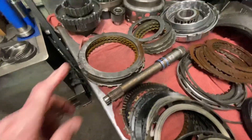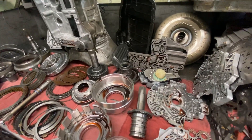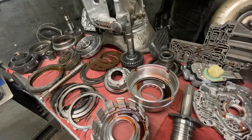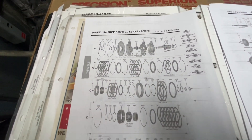Here's the input shaft. They do have upgraded input shafts. This particular application is a work truck — it's not a truck that the guy's going to be doing any heavy modifications on. So we looked at it and figured that the modification to the housing, which is very prone for problems, is probably about all we need.